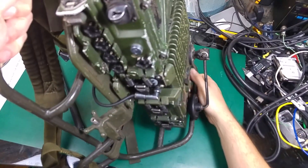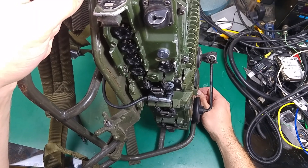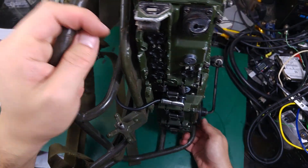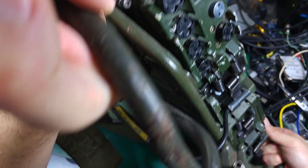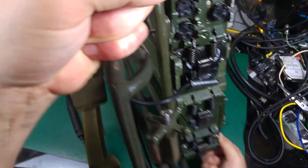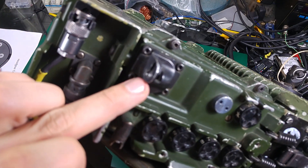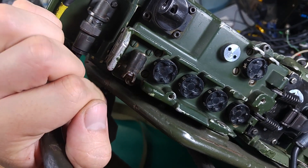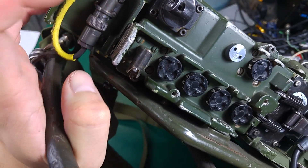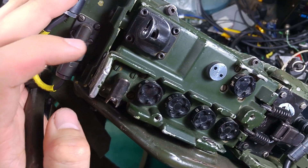I'm currently in the ISM band because I was trying to listen to a baby monitor to test the receiver circuitry, and it was okay, so I know it's working. Over here we've got a BNC external antenna output — this is a standard BNC socket, commonly used. It's very important to use only one antenna at a time: either the whip antenna or the BNC. Over here you can connect an antenna like the ground spike antenna directly and you don't need anything else, but if you operate at close range with another radio you will get interference.